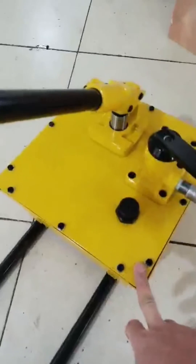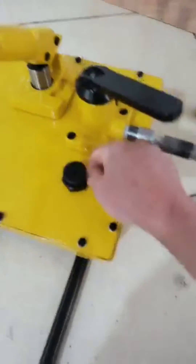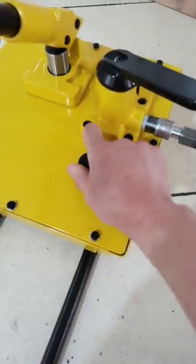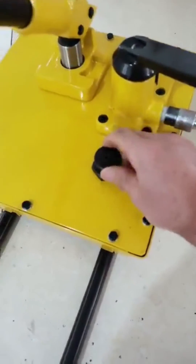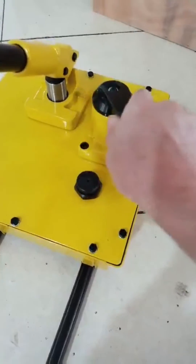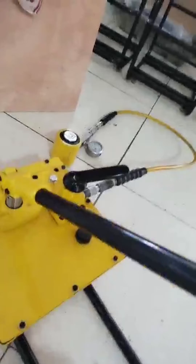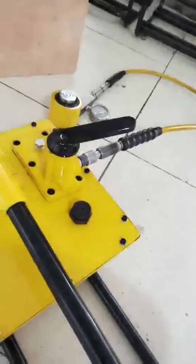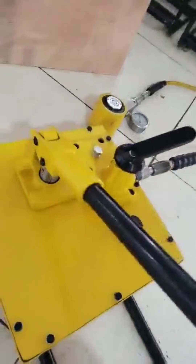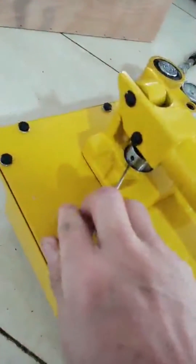In order to get the air out of the plunger of the PGAN-462 hand pump, you need to turn clockwise the air relief valve of the hand pump. Turn clockwise, and then press the handles several times. You will see there is no suction of the oil, because there is air in the plunger.